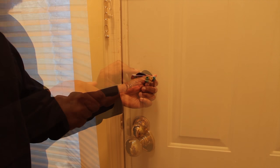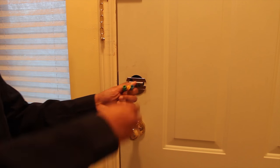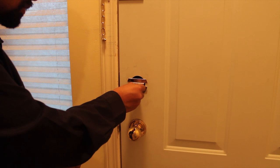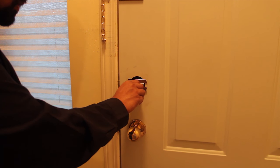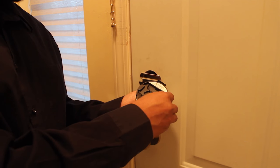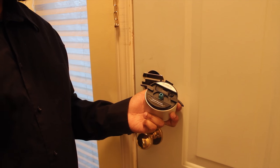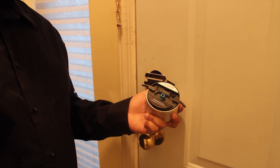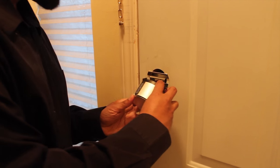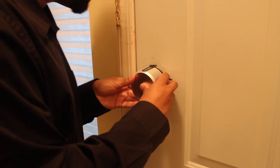From here, you need to figure out which mounting peg you need as it varies by brand. The owner's manual has an easy-to-follow legend though, and to be on the safe side, I'd test it out before you start the next step. Next, stick that peg in the back of the August lock itself and pull open the wings. Now be careful that you haven't screwed the mounting plate in too far, as if you get too much resistance on this next step, you could snap one of the wings even though they are made of metal. Fit and snap that deadbolt into place.